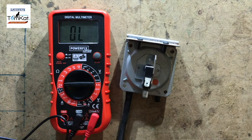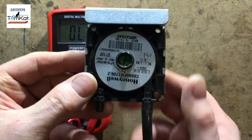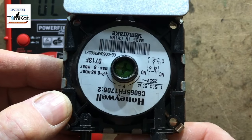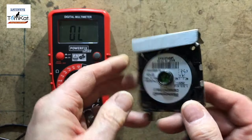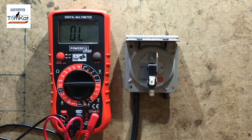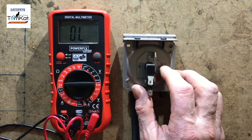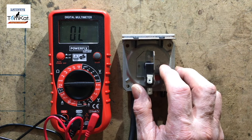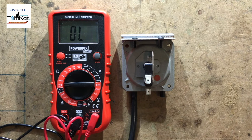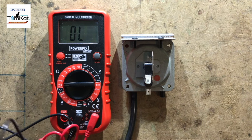Okay, now, if we look at this tube, I flip it over, you can see it says high there and low there. Now this black tube we know was attached to the fan. So the fan is actually, by the aid of Venturi's, sucking the pressure switch open rather than pushing it open. So I told you before we should never be sucking on an air pressure switch, but I've got to do that to show you how it works.